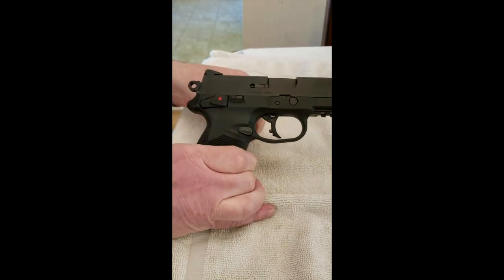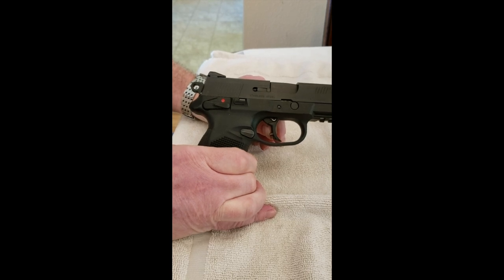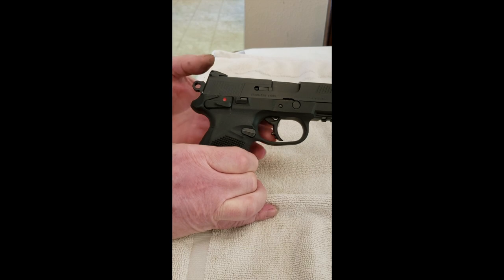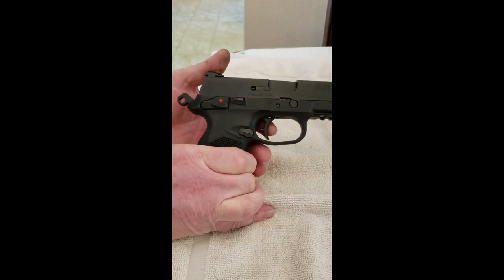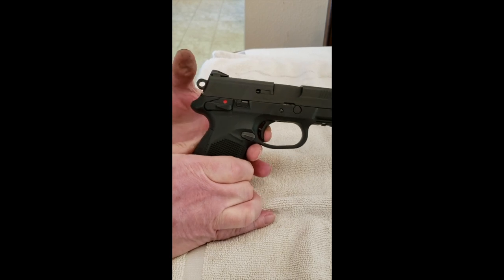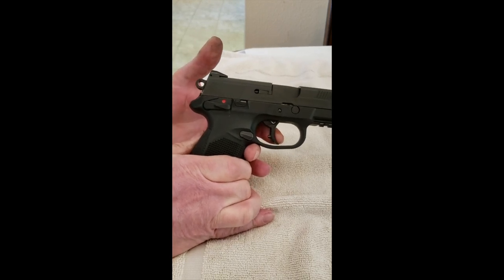The other thing I can do for it is drill and tap your current trigger for an over travel screw. This will allow a quicker reset in the 25 to 30% area by less trigger travel forward for reset operation.